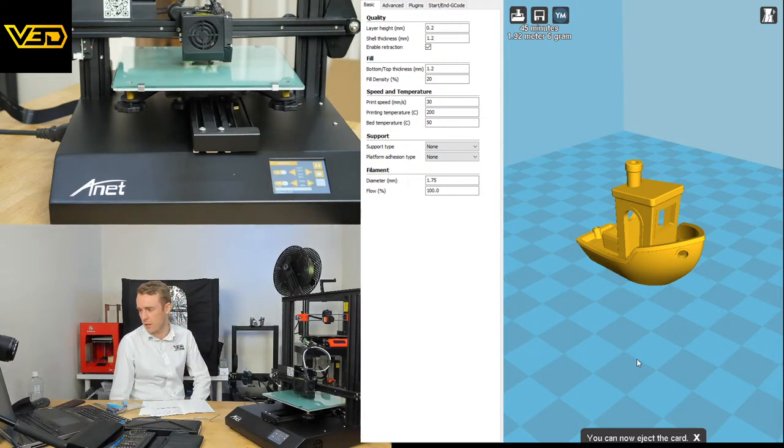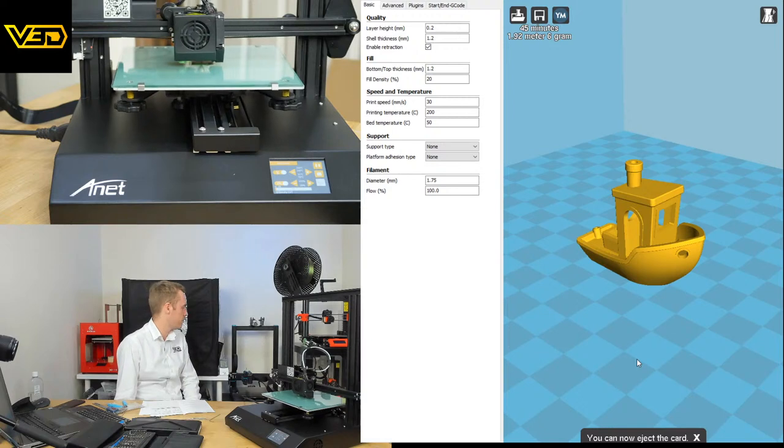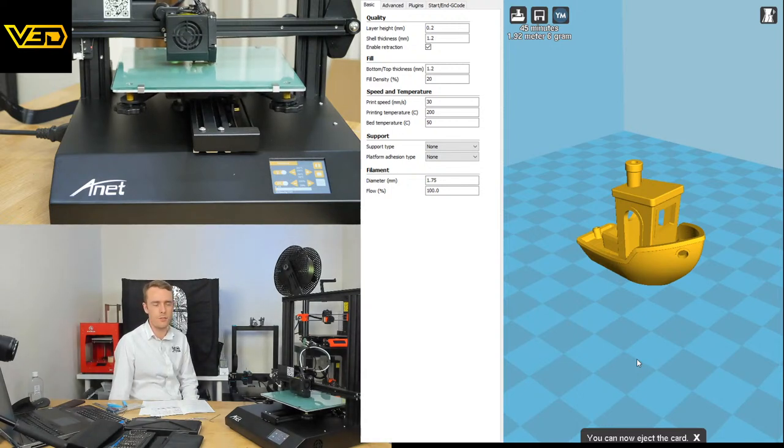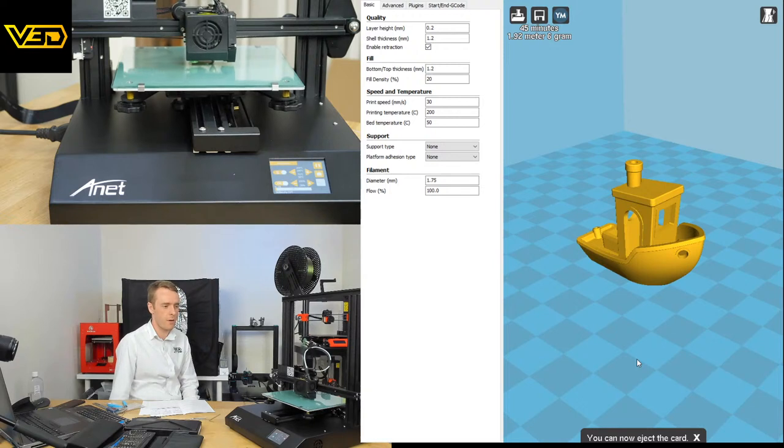Textured bed surfaces I find really good for PEI. I use textured beds a large amount of the time. They do work really well. Yeah, you can use hairspray, but it's also super messy and super annoying and gets everywhere, and it's more expense than you need. Just clean the bed.